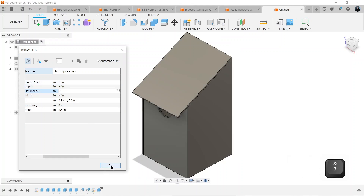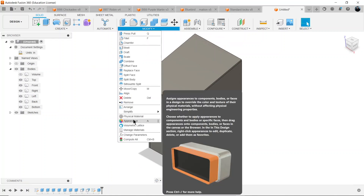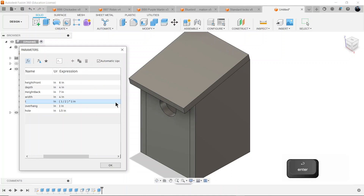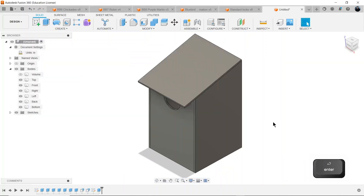Now I can turn off that volume. I want to show you that you can modify your birdhouse for any bird by changing these parameters. I can shrink it so we can see — I could make the height of the front more or less, seven inches; change the width to six; change the back to eight; change the hole diameter — any of those things can change. I'll go back to my original Carolina Wren dimensions. This also shows you could use half-inch wood and just build it with screws, but I'm using thin one-eighth-inch laser cut wood, so I'm going to build in notches, since glue isn't recommended for the health of the birds. I'll change the push-pull amount to three times T — three-eighths of an inch in my case.